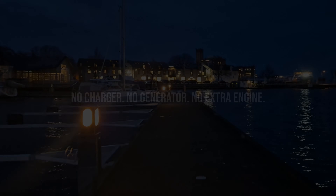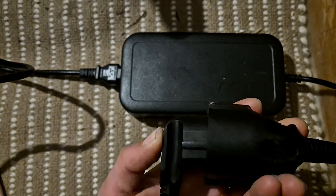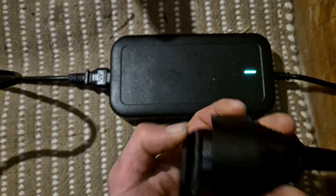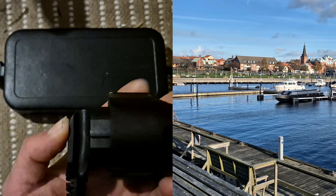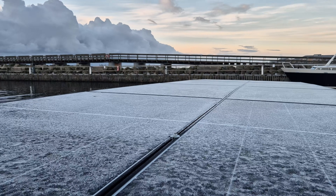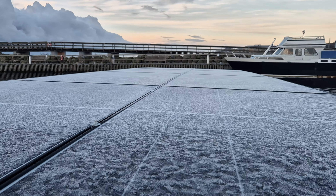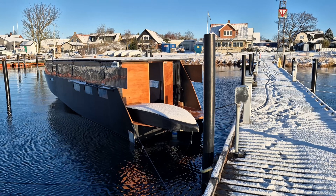Back to the systems. Early on, I also tried too hard to prove solar — I didn't even install a charger. That was a big mistake. A mid-speed charger that restores roughly 50% of battery capacity overnight costs very little, weighs almost nothing, and dramatically increases operational flexibility. I basically got this system for $150 and it's been very useful. From a systems perspective, grid charging isn't a failure of solar design — it's an efficiency multiplier when you're in low light conditions such as the Nordic winter.